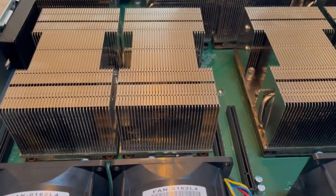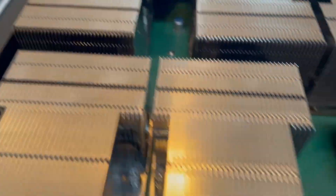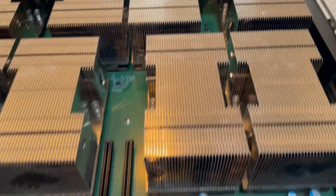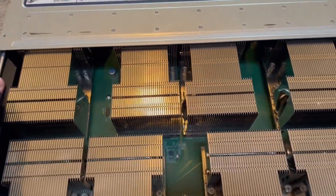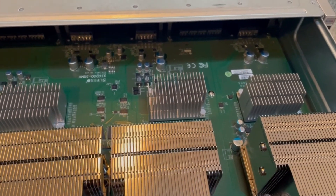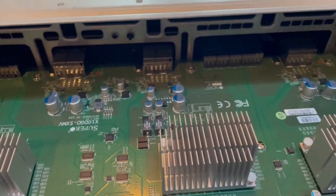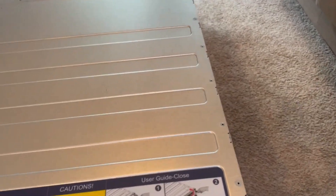I can't really do much benchmarking anymore since I already sold it. I'm just going to show these up close. It's really kind of impressive how they actually managed to use these — since the traces are so long, I figured there'd be a lot of delay, and they might have some issues with syncing. There might be some signal interference on the long traces. You can see in the back there are some more heat sinks, which are probably some sort of multiplexers, and then it goes into an interplane connect in the back. That's how most of these large servers are — processing in the front, a midplane in the middle, and power supplies in the back.